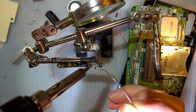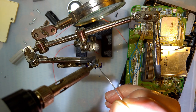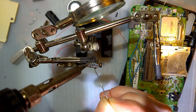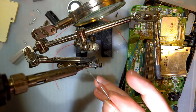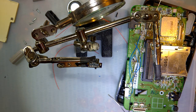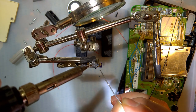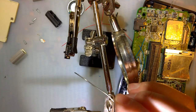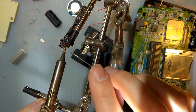We only need four of these six pins here, because the other two aren't connected. The other two should be the current sense lines, but they aren't hooked up on this adapter. And I think this is going much better than last time. And the whole purpose of this out of focus, I swear it's in focus in person, USB Type-C port is because I don't have, ooh, that's hot, an extra, I don't actually have a DS Phat charger.